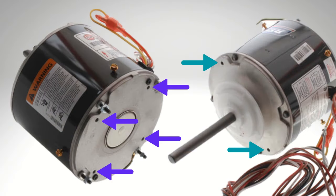Another reason this can happen, especially on universal replacements, is the inside of the motor got wet. These motors come with rubber plugs sometimes, and those plugs have to be placed in the top side of a downward-mounted fan and in the bottom side of an upward-facing motor. The ports on the opposite side should remain open so that any moisture that does get into it can drain out.